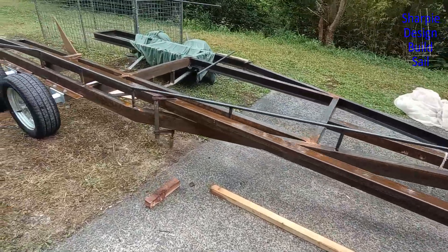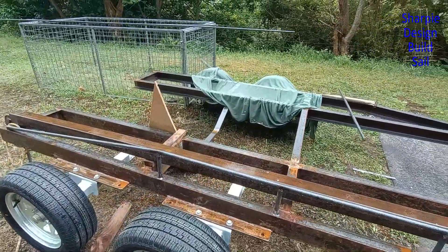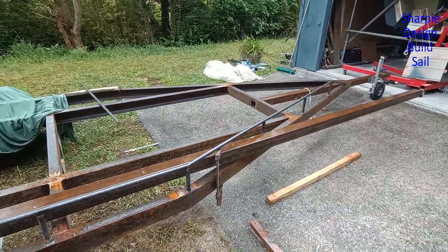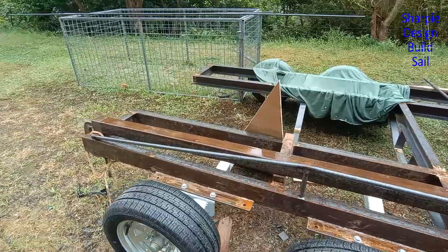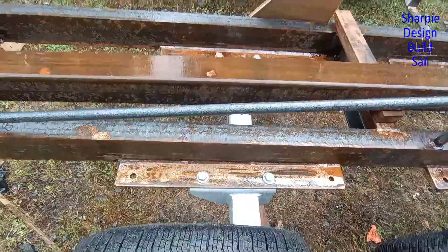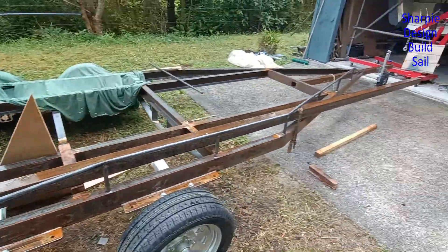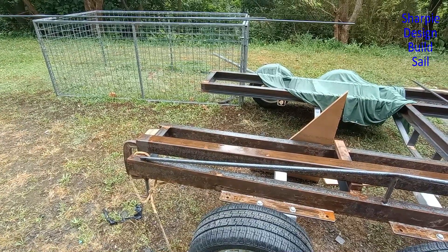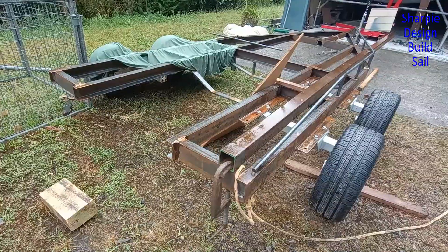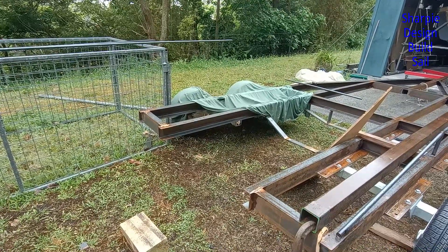It's raining today so I can't do much on the trailer while it's outside, but I started setting up this strengthening rail above the side rail there. I'm making it out of 20 millimeter solid round, because that welding pulled that rail out of straight a bit. I'm actually straightening it down by putting RHS on top — three inches by three-sixteenths wall.